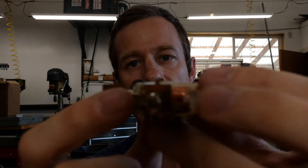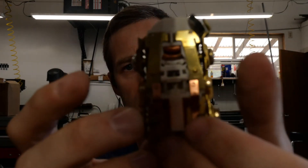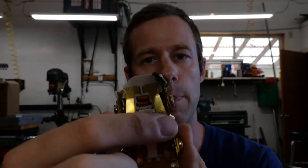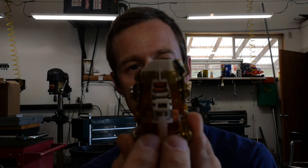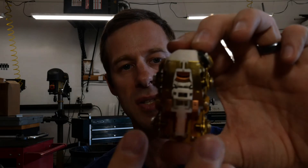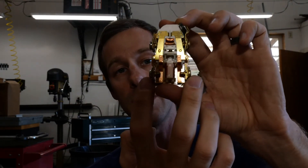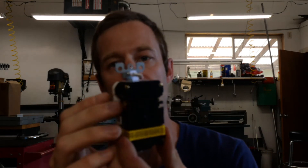There's another really interesting thing about these GFCIs. When they are energized — meaning not tripped, they are reset, they are working properly — then these two tabs on the side, one side and the other, are pulled up to meet the copper tabs at the very bottom.